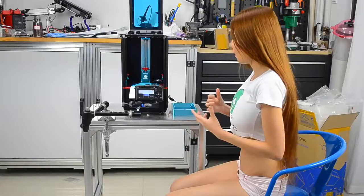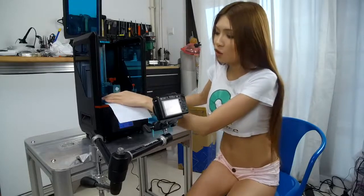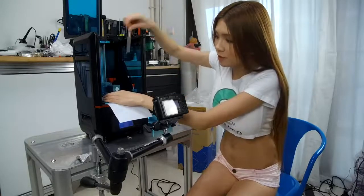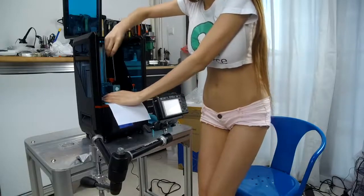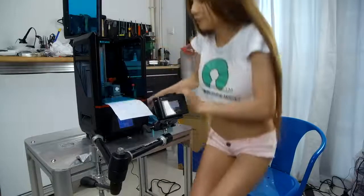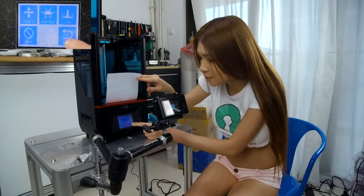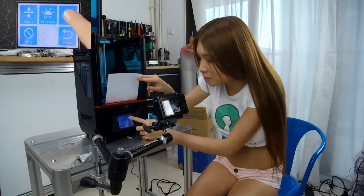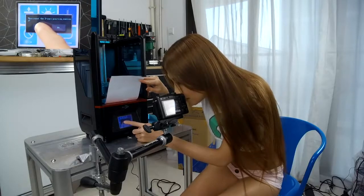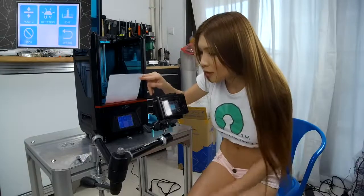So I think that's it. There is an insert screw inside — we need to tighten it. Put your hands on the build plate and let the build plate lay flat on the LCD screen, then tighten it. I think it's done. Let's go back to the previous menu and press Z equal to 0. This resets the Z0 position — press Yes. So every time you print, it will always start from this position.